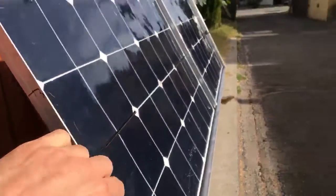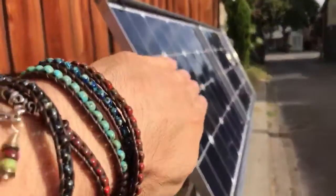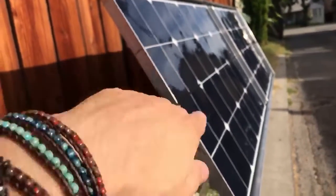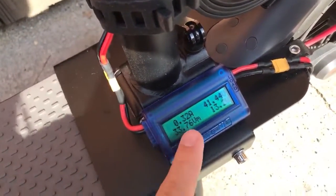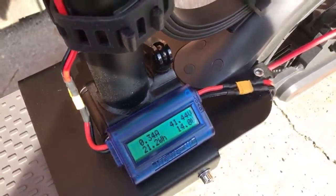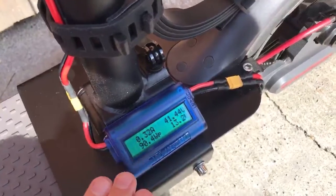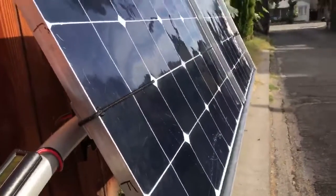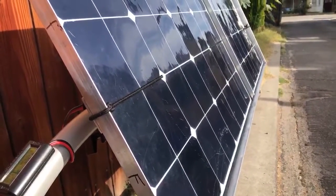And then I leaned it toward the sun. As you can see, the sun is over there. It's like a 45-degree angle. So I leaned the solar panels a little bit more than a 45-degree angle, a little bit down. And what's happened is the amperage doubled. It went to 2 amps. But then it quickly charged. So as you can see, it's taking less than that now because it's full. But I'll do more testing where it shows that when the battery is lower, it'll actually receive that higher amperage. So the amperage drops down as the battery nears its full charge. But just by tilting the panels, and I'm looking into, my research and study indicate that there are ways of, let me think what the material was.